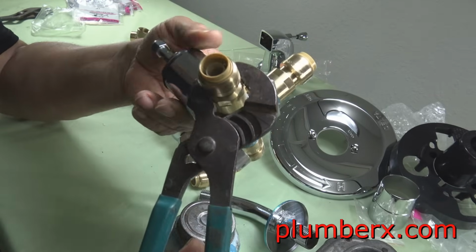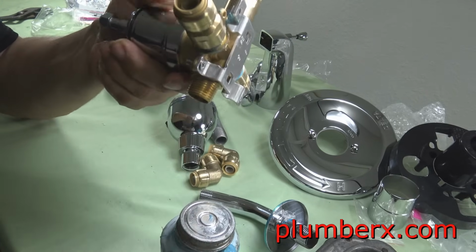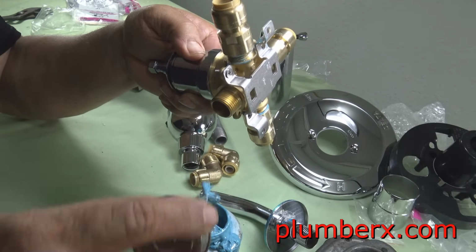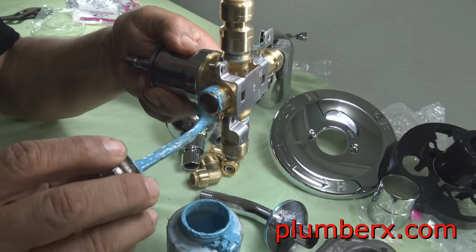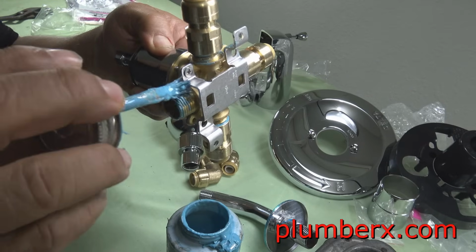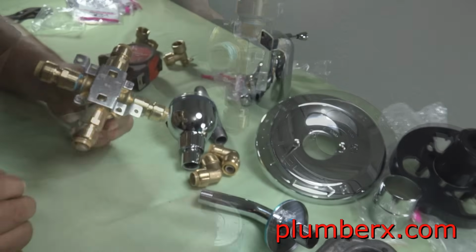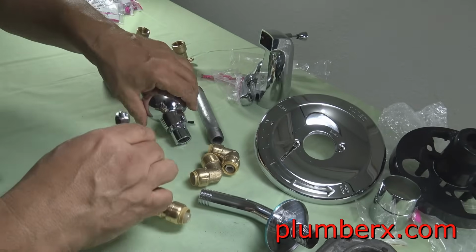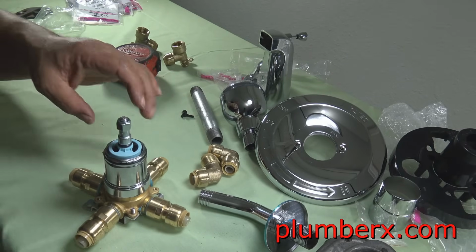Okay. Now that we just about have all of them on, I am going to start tightening it with my channel lock pliers. And the reason that I didn't pipe dope them all up at once is because I didn't really want to get any of this pipe dope on my hand. So I just pipe doped it one at a time. Okay, now we have it all together.